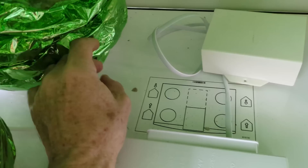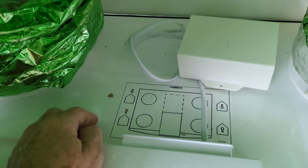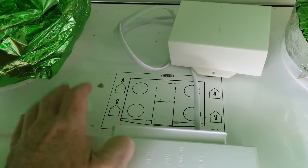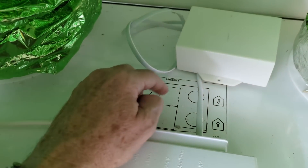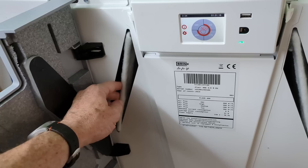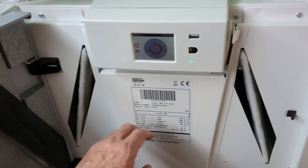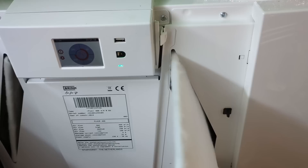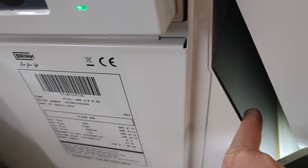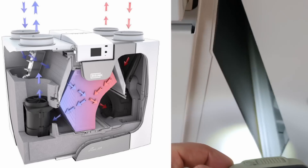Here's the little diagram on top. This vent here is for air coming from the outside. This vent here is for the exhaust air going out — it'll extract all the exhaust air from the bathroom, range hoods, stale air — and send it outside. So this side is internal air coming from the house and back out, hence why it's got two filters. This is where we install the one micron filter for the incoming air, and this is the outlet filter where we'll keep the coarse filter. Inside you can see the metal grill for the heat exchanger — a hexagonal shaped unit inside there.